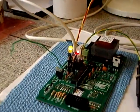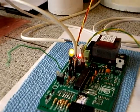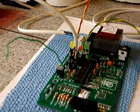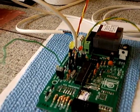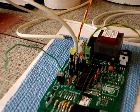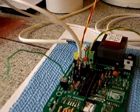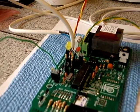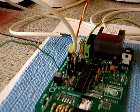At the end of that, the two lights should come on, because this is how the display comes on when it's in standby mode. So if we now repeat the test and put a couple of kilowatts on — I've increased the calibration value for CT2, so I'm expecting it to now go faster than CT1. I'll put the power down to just 750 watts, and we're now seeing that the yellow one is going substantially faster than the red.